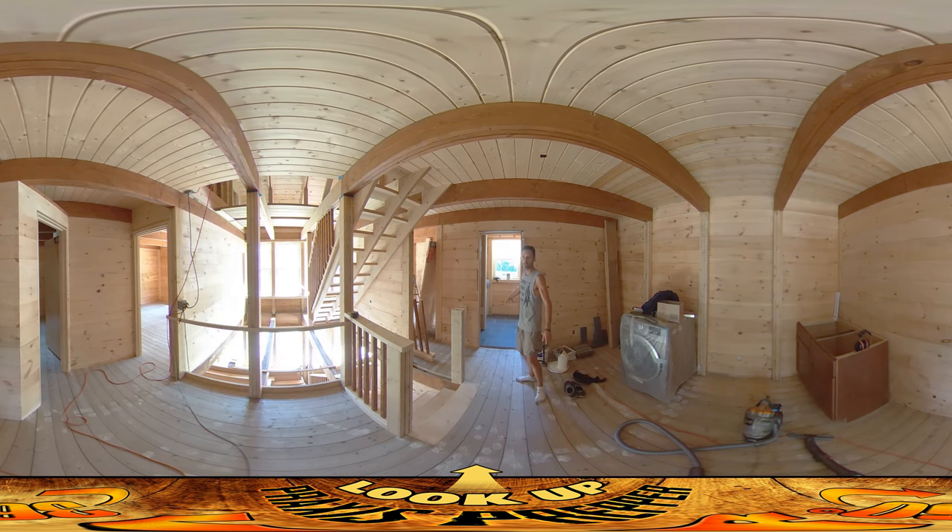The next step for me today is I'm going to start putting the tung oil on the floor in here. I finished the tung oil on the stones downstairs, and I'm going to start this area because nobody needs to go in there for the rest of the day — you really want to let the tung oil dry. One thing I forgot to mention the other day when I was talking about tung oil: after you get it on with a brush, you really want to wipe off the excess with a rag. This is a piece of a ripped-up shirt that I was using. If you don't wipe off the excess, when it dries you leave a gummy surface. So you want to polish it all up — a rag, in this case the arm of an old shirt, works perfectly for that. That's it, thanks for watching.